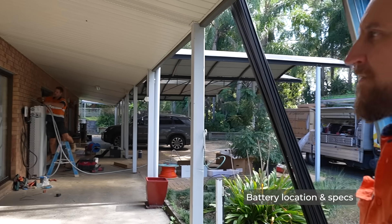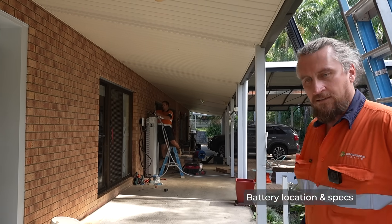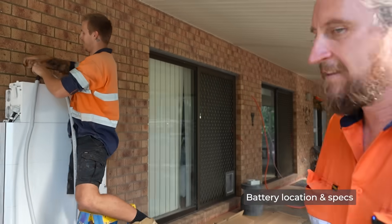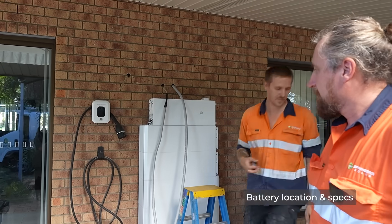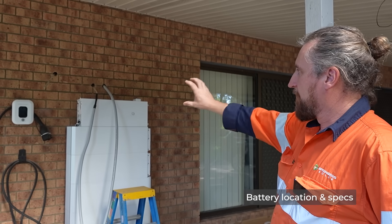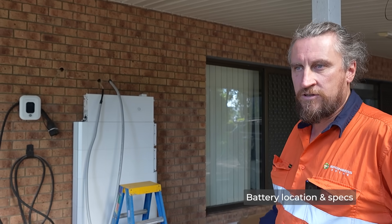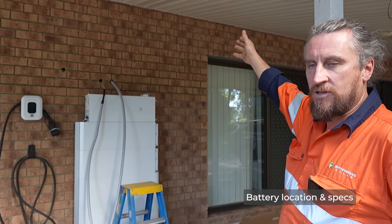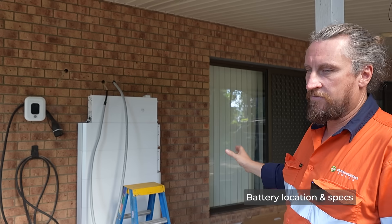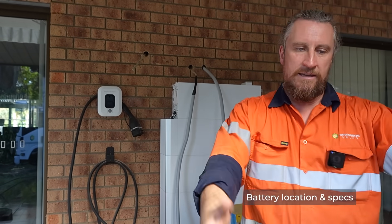Location for batteries is always a challenge no matter what property. We're very lucky here that we've got ample room on either side of the glass doors. Each block we've got here is 8 kilowatt hours. There are larger ones coming but these are the ones we're working with right now. The box at the top there is the 25 kilowatt DC charger, which in the future may be bi-directional, software permitting. And on top of that we're going to have a 25 kilowatt inverter — that's typically how they like to have their stacks done. We've got lots of room on either side, and we chose this location so the DC charger has enough cable to reach where the EV cars are going to be parked.